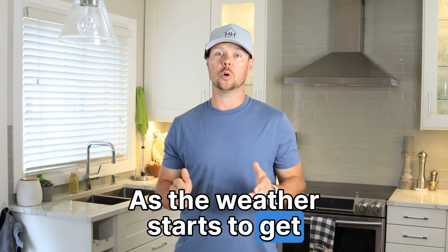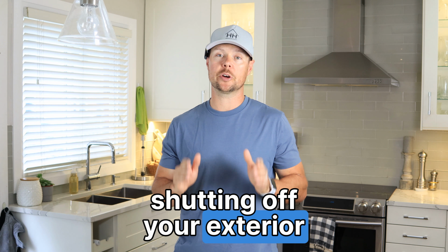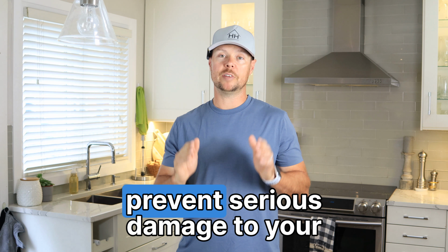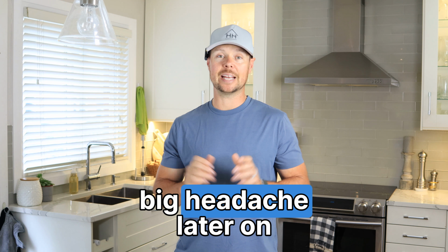As the weather starts to get colder, one important task you don't want to forget is shutting off your exterior hose bibs from the interior of your home. This simple step can prevent serious damage to your plumbing and save you from a big headache later on.